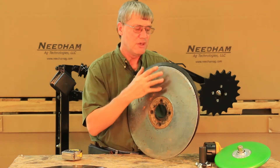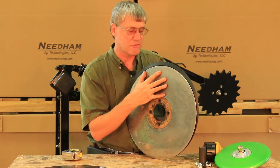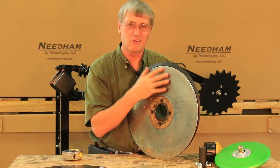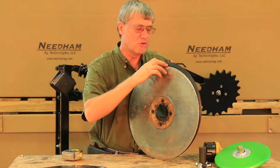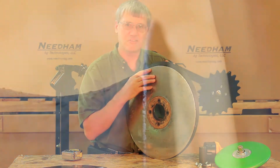The only exception is if you're working a lot in rocky areas with hard rocks like granite. We have customers in South Dakota, North Dakota, and New Zealand that are farming on granite rocks, which are very hard and tend to dull the blade much faster. So look at the outside of the disc blade — if it starts to become dull before it reaches 17 inches, it's not going to cut and it needs to be replaced.